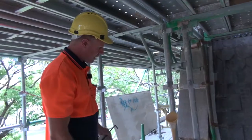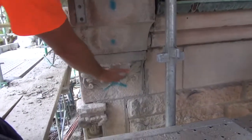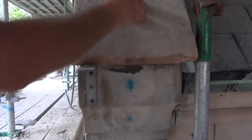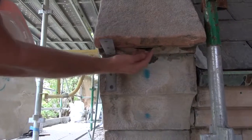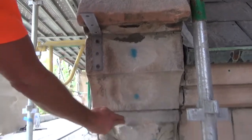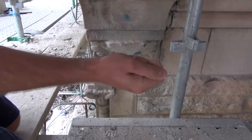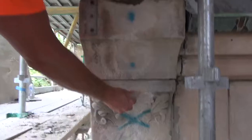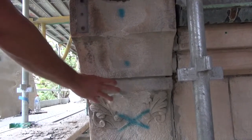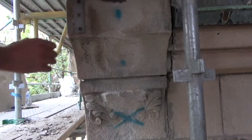As you can see, these stones here have lost all their detail. There was actually a carving that protruded about 100 millimetres out this far. What's happened is water has come down here — the drip mould, which is underneath the stone, has been lost. As you can see, I can pull a lot of the stone off. The water will now track down the face, across here, and wash everything away. That's how soft a lot of the stone is — you can crumble it up. So what we're doing is we'll replace this stone as an indent — not a full replacement — and put the detail back on. These will be mortar patches: we make up a mortar repair mix, match the colour, chip it out, and replace it with some pinning in there as well.